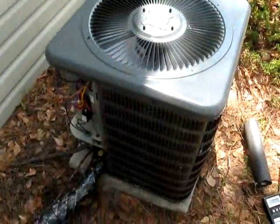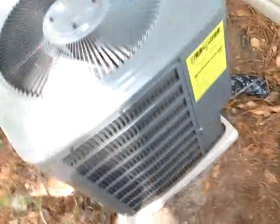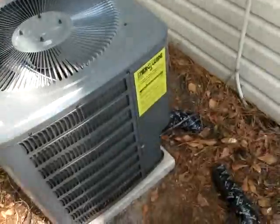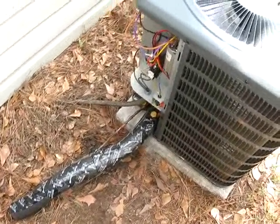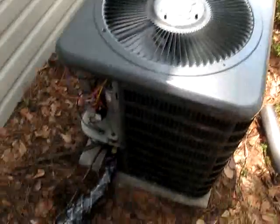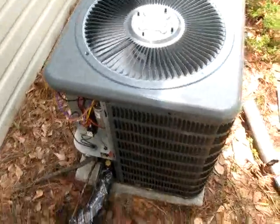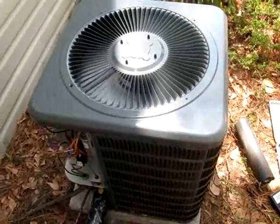Our Goodman is all up and running now. I had to put the service door back on, our line's insulated. Even jacked up the unit next to it — also a Goodman from 2009 — insulated the line with thicker Armaflex, taped off the wire, repaired and shortened the wire because you'd move the wire and the contact would go in and out. So we're about done with this one. This is a GSC 130 18, one and a half ton, 13 SEER, dry-charged unit.